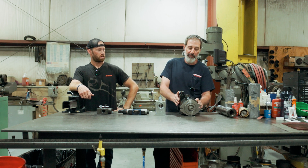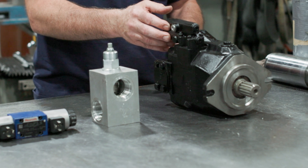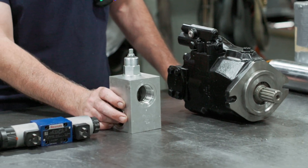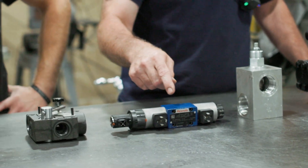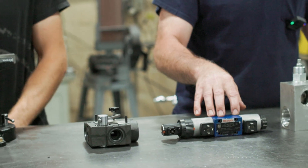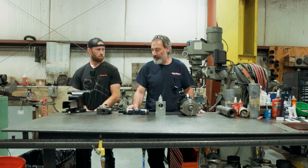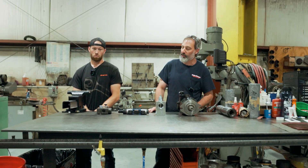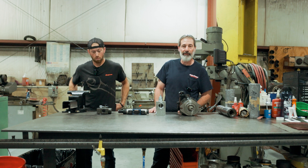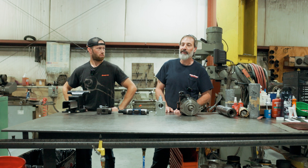So here we got a hydraulic pump — it would be pressure compensated and load sensing. Here we have a pressure relief valve. We have a pressure control valve that has a pressure control with feedback to an electrical signal for system feedback. And here we have just a priority flow control — it could control the speed of motors in a system like for a conveyor belt. This is just the tip of the iceberg when it comes to pressure control valves.